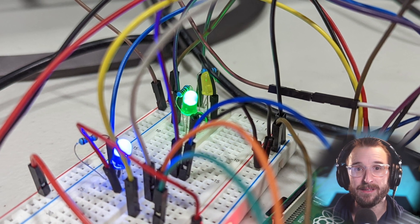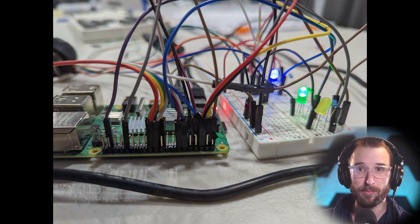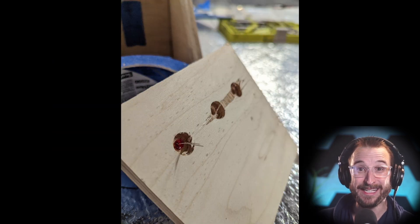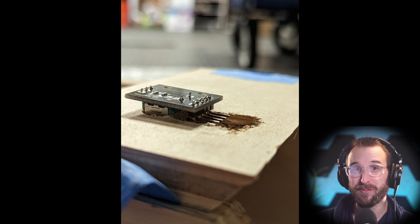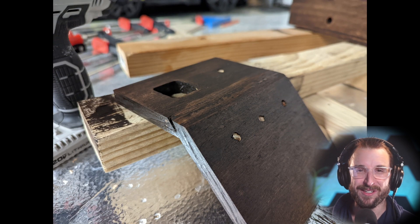The LEDs are limited to avoid too much light in the room. The green LED turns on when the Python script is ready to scan a card. The blue light changes brightness depending on the volume percentage. The yellow light pulses when audio is playing. The final feature is that I'm gathering telemetry about time and which book is played. Over time, I will be able to know which books she prefers, how long she has been playing audiobooks at night, and I could improve the machine's efficiency with all this data.